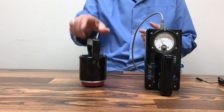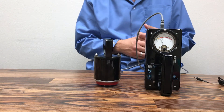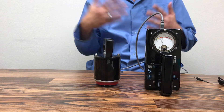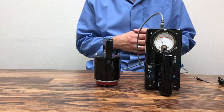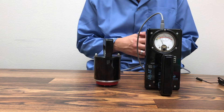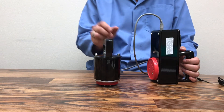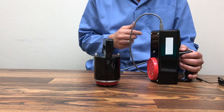We make sure the buttons are not flat and then run through a series of four standard blocks in-house. Our service also provides a calibration certificate which you can use for auditing purposes for an ISO agency or any other agency performing an audit. You can also perform two partial calibrations on-site yourself: one using the red standard plate internal calibration, and the other using a calibration check accessory that is sold separately.